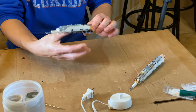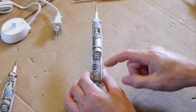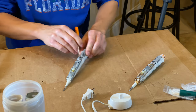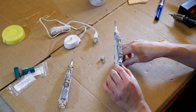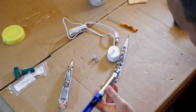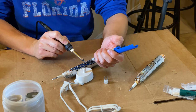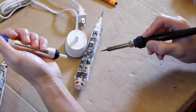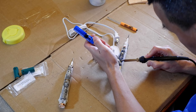First thing: make sure you remember the orientation. This one has positive going upward, so note that for the terminal. There's also a little spring here — pop that out and set it aside. Since this one uses the shorter battery, they put a little spacer spring in there. Get your solder pump ready and your soldering iron heated up. Put the tip onto the solder joint, wait for it to melt, then suck it up with the pump. Do it a couple of times to get all the residuals out.